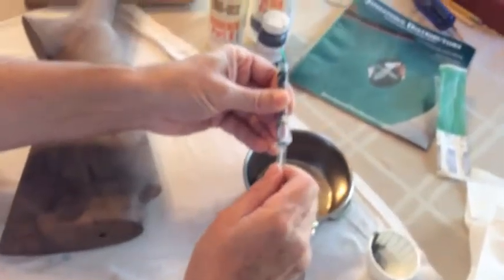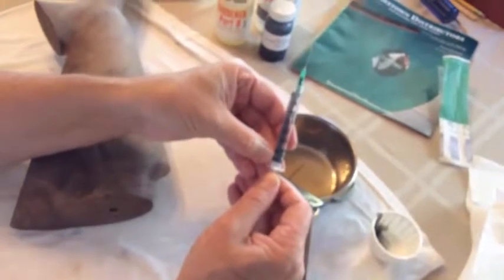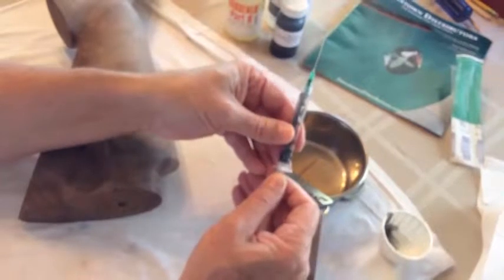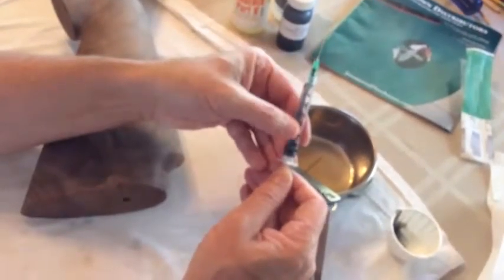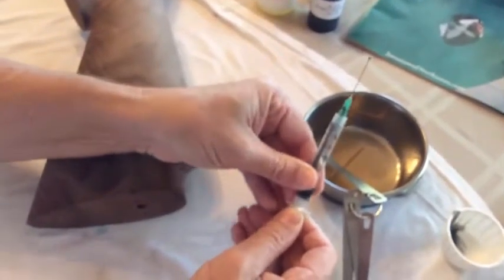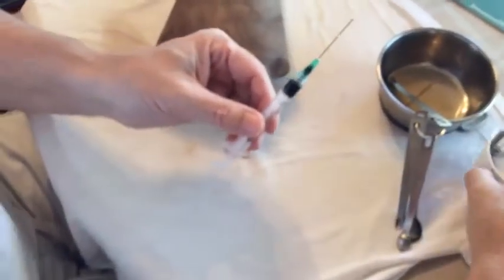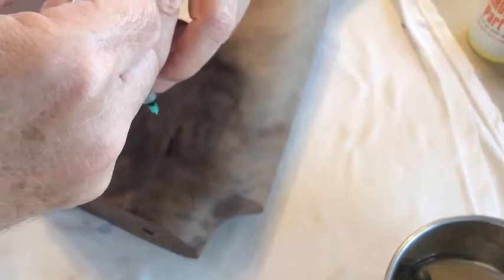You want to tilt the stock up just a little bit. The syringe can catch in there — there's a little edge. If you haven't worked with syringes before, when you're going in you think it's kind of stuck, so give it a chance to come back down. Otherwise when you push, it's going to come squirting out everywhere. So we'll take that syringe and set it right down into those cracks. That's why I shaved off the top — it allows me to get straight down and force the epoxy in there. Give it a little shot.